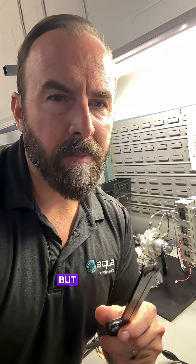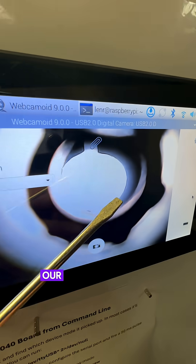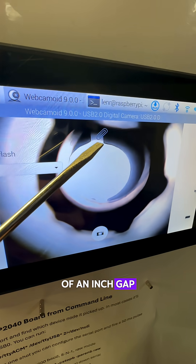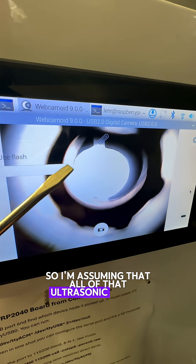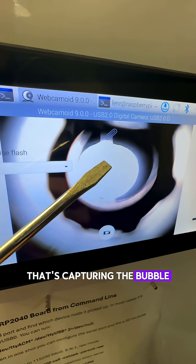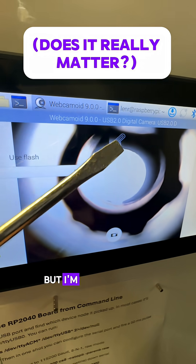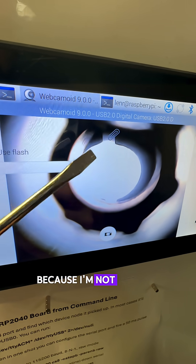There's one other thing you could take as a huge disappointment, but I'm not too concerned about it yet — the position of this bubble relative to the center of the sphere of this reactor. Our USB microscope is focused right on this sharp edge right here and you can see the split between the two hemispheres on the top and bottom. That's a 20 thousandths of an inch gap. It looks like the bubble is really in focus here, so I'm assuming all of that ultrasonic energy is shooting into these little tiny portholes and making a low pressure zone that's capturing the bubble at the opening of these ports on either side, rather than in the center of the sphere. I could be wrong — it could have been at the center of the sphere too — but I'm going to assume the worst and assume it's actually in that port zone. I don't believe it's on the glass window itself because I'm not focused on that.